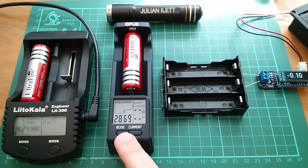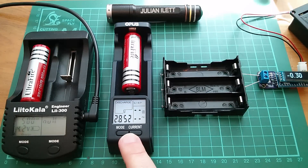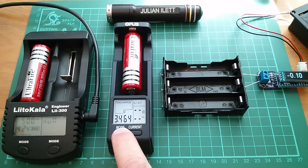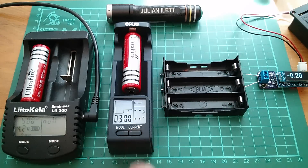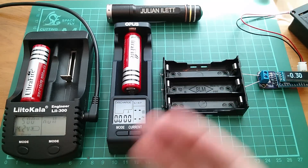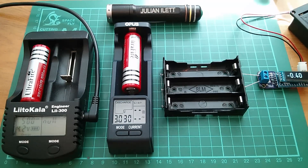The one that's discharging is close to its minimum - I think it stops at 2.85 volts. This one still hasn't terminated yet. It's stopped discharging at half an amp, so I'm going to press and hold to re-establish a discharge, and ease the current down a bit - let's do it at 300 milliamps. So 3.1, 3.0 - that's shooting down pretty fast. It's not going to last long at 300 milliamps.